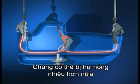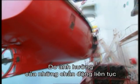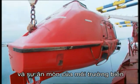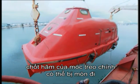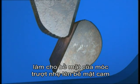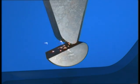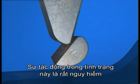Things can deteriorate further if effective maintenance is not carried out. With constant vibration and in the corrosive marine environment, the main load-bearing hook pivots can become worn. The weight of the lifeboat pulls down, causing the hook face to ride up the cam face slightly. A system in this state is potentially very dangerous.